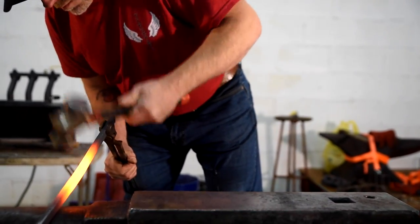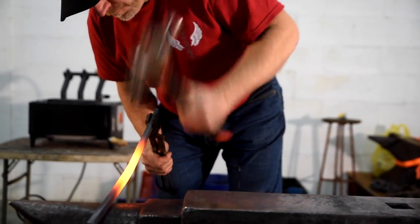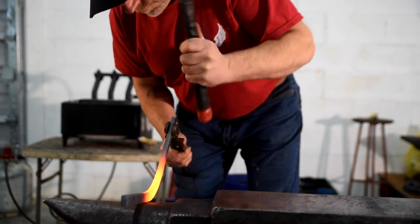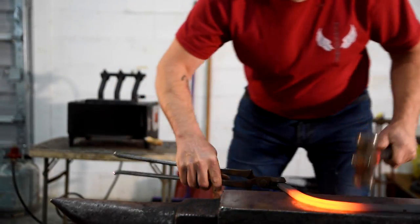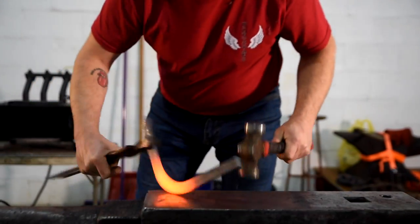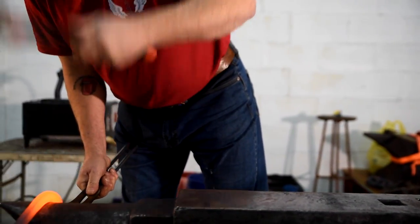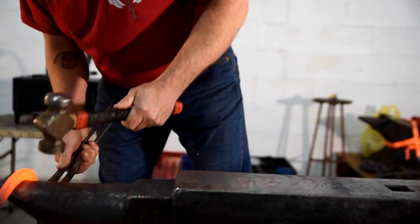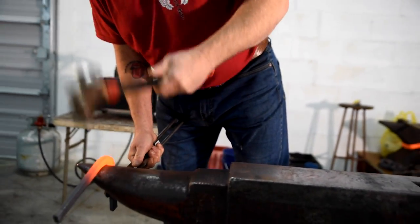So when it comes to turning the toe of any bar shoe, obviously it's about trying to keep the toe balanced and keeping the toe in the middle of the section. We need to have the branches both the same and we set the toe off from that. And because you're taking such a long piece of material, you've added the amount of inches you need for the space of the heels for the bars and to forge them.